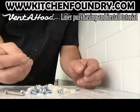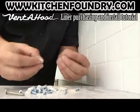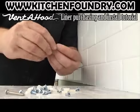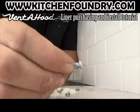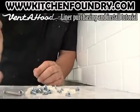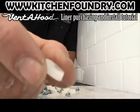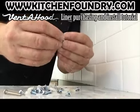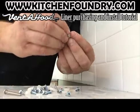Here we have the screws that are going to be installing our hood. This is called the TK kit, and we have these dual washers. One fits the head of the screw, and then you put a flat washer underneath. I like to get all these prepared and ready to go, so when my hood is up in the cavity, I'm literally just screwing these in around the radius, all four sides of the hood.